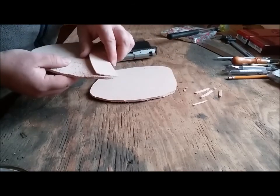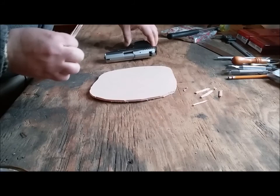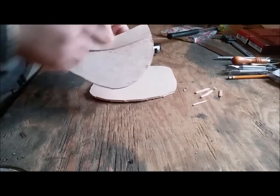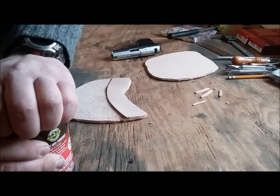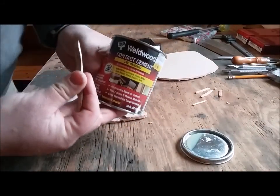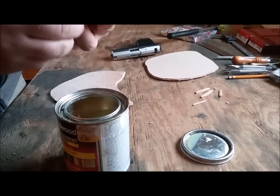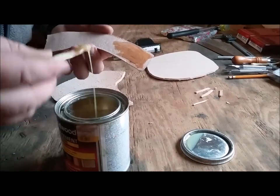I'm going to add an extra piece of two-ounce leather to this nine-ounce to help make it firmer, which will prevent things like a bump from getting in and catching the trigger. And it makes it kind of cool. So what we're going to do right now is get this all prepped to get stitching all the way around it. We're going to open up a container of contact cement and coat this. This leather will absorb a lot of this, so I've got to put it on generously.